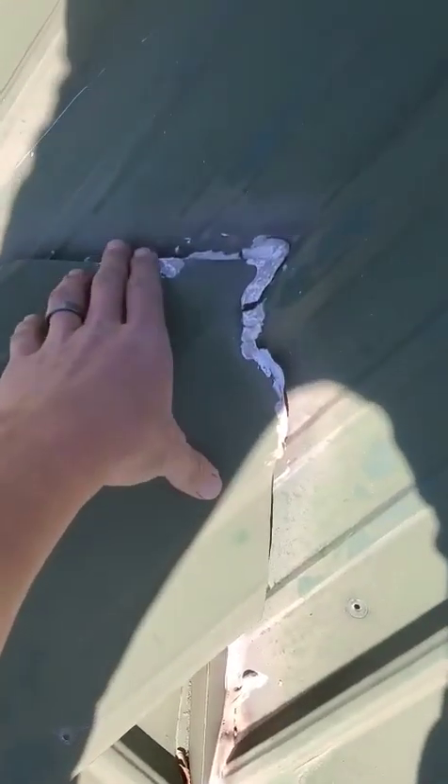This leaks a lot right here. So if you got a house with a dormer on it and you got two valleys that meet up there, that's a really high area of leaks. When people have leaks on metal roofs and they got a dormer, it's almost always leaking up here.